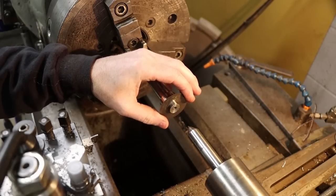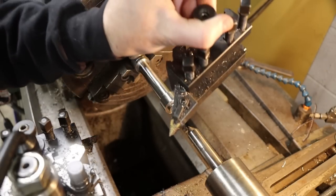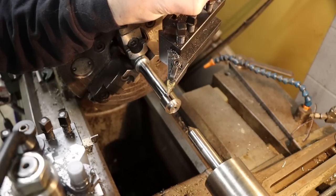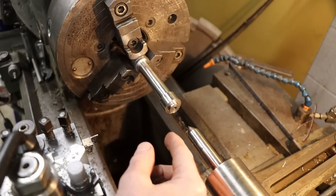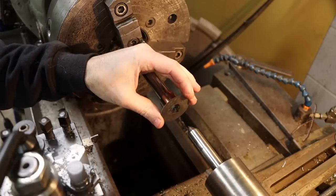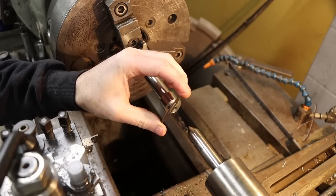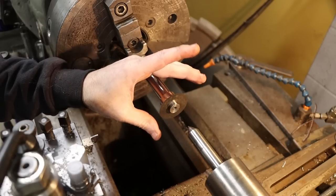There's not much of a radius there because it's such a small BNMG, really small radius on the end of that cutting tool. But I assure you that the radius on the end of that tool is what's left in that corner, and we want to delete that, but pretty much only that. We don't want to undercut this any, because the saws that I'll be using on this arbor are super thin. So it may not even make hardly a chip.